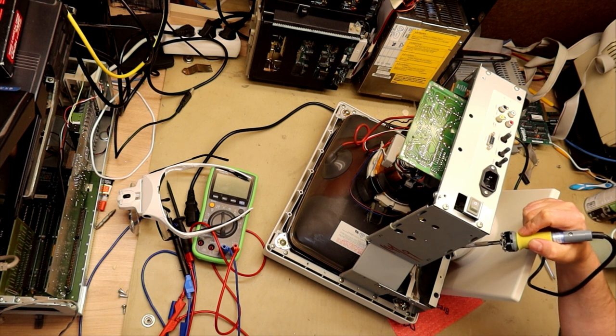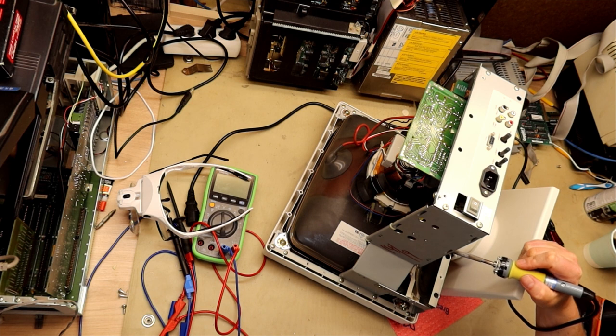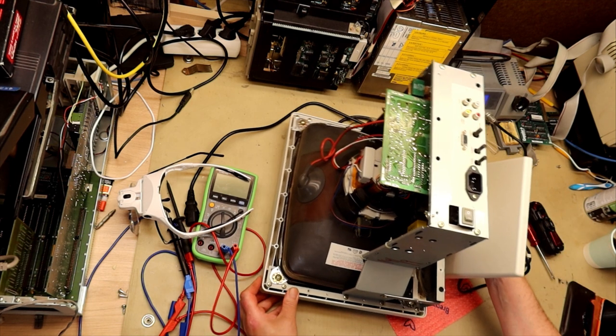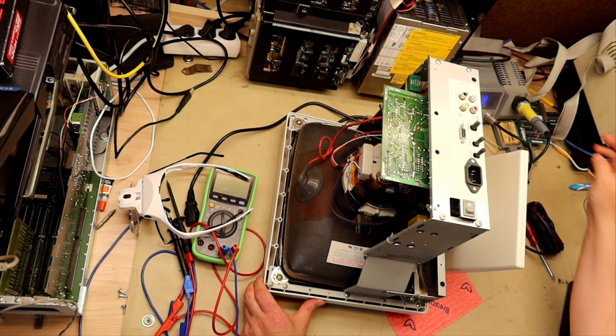is to take out one of the power resistors that I looked at earlier, because I can't figure out what value one of them has. It measures at 11K, but I can't find any writing on the viewable side of this. So I'm just going to take it out to see if this is the right value, or if the value might have changed from getting too hot.